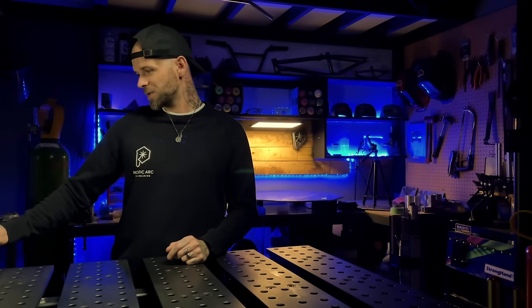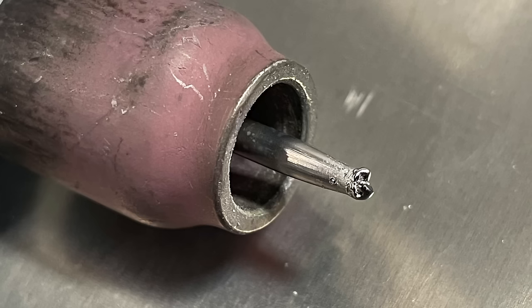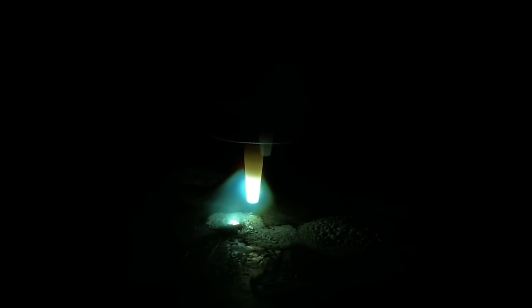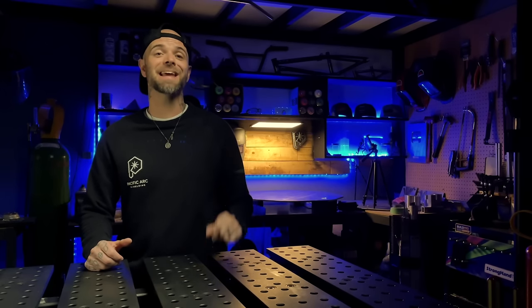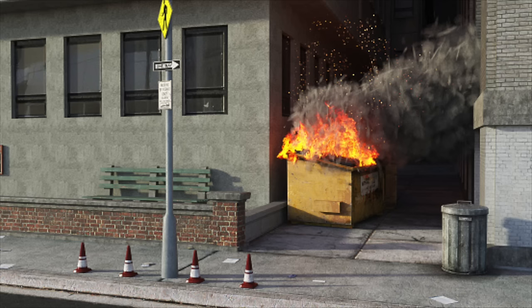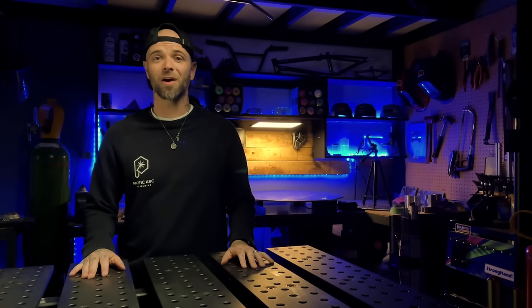What does your tungsten look like? Is it mashed up and dirty? Has your balance been set incorrectly so that after a few welding passes, the end of your tungsten looks contaminated? You need to swap it out immediately, learn how to clean a tungsten properly, and how to set your machine up to get better results keeping the shape of the tungsten the way you want it. My students start out simple, figuring out what type of preparation they prefer and how to set things up properly and then maintain it. If one of these tiny factors is not put together correctly, no matter how much acetone you use or how much you wire brush your stuff, these weld passes are going to look like a flaming dumpster. Do not start practicing until you have learned and confirmed this step. Do not waste your hard work and time practicing when it's something so simple we could have taken care of right at the beginning.